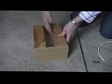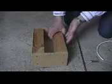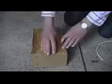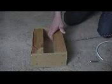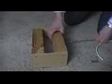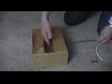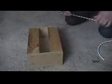You have got the cavity, as you can see, and quite a lot of times when you're drilling a hole for a wall, you get debris inside of here. When you pull the drill back out, the debris falls back down and you can't get it through. Thus, when you push the coat hanger through, it gets snagged. But this is a fail-safe way of doing it, and I shall just demonstrate how.